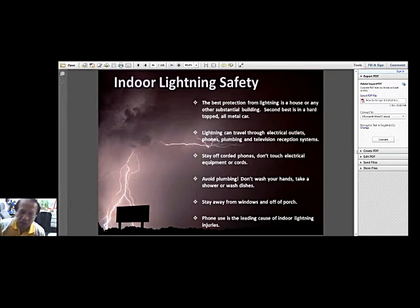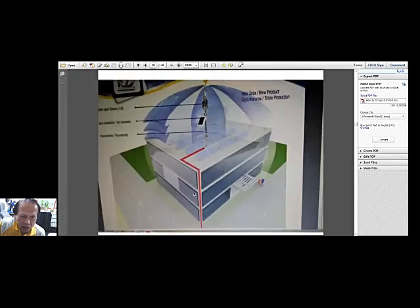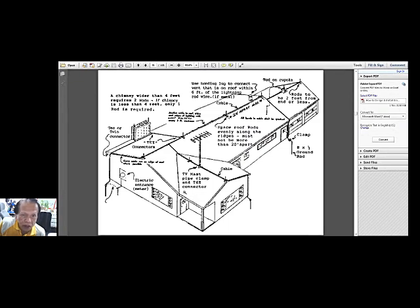Okay, one ground rod on each end. As you could imagine, an elongated building, or maybe let me just go back to this slide. So here, say for example, if you only have this very long building here, if you have so many air terminals here, 1, 2, 3, and 4, then you have one ground rod here with one down conductor. Then maybe you will have another one in here, one down conductor here, and another. That would be the minimum that would be provided, because there is this part of the building here. Then that included another one.